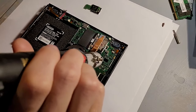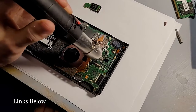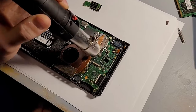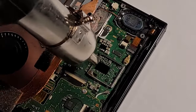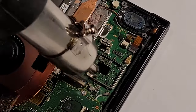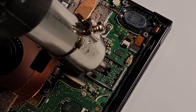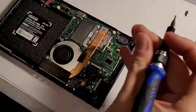We're gonna grab a soldering air gun — link's in the description. I jacked mine to max airflow at about 450 Celsius, and you just sit here and wave it around. Make sure the heat saturates around the chip so you're not bending the PCB too much or heating one side of a component more than the other, causing it to crack. Keep it moving, and sit here for literally five minutes. It'll hopefully get that solder just a little bit melted and fill in all of the cracks that are causing your orange screen.